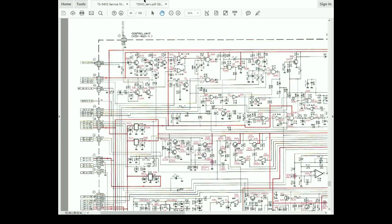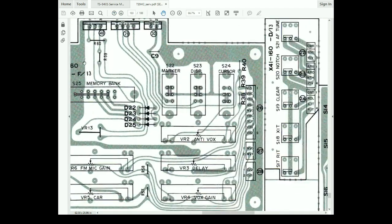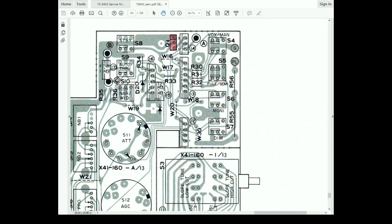But, whoops, going back to our board pictorial, that's obviously not the case. So here's our lamp, powered to our meter lamps, and here's our ground, also to the meter lamps, and it goes to chassis ground, but it doesn't go to the chassis ground associated with the dimmer switch. It goes to the chassis ground associated with the VOX switch. Isn't that interesting? So here's what's happening.